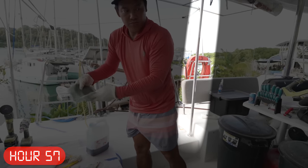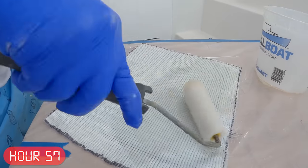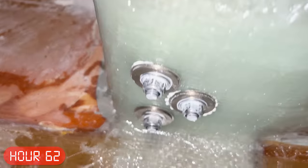This is me complaining about Mary making more work for us. She pointed out some tiny cracks in the gel coat at the base of this pole. I checked under the deck and sure enough the bolts had pulled into the deck. Surprise — more fiberglassing, thanks to Mary. That's our traveler above the roof; the post connects the traveler all the way to the deck. The fiberglass underneath was cracked. We glassed the heck out of it — taped up into the side, down into the bulkhead, across the deck. Only took five hours. Then I put triple washers: one huge fender washer, a smaller fender washer, and then a smaller regular washer.